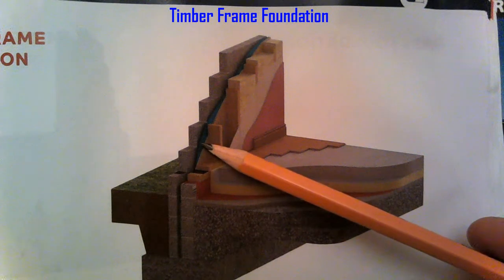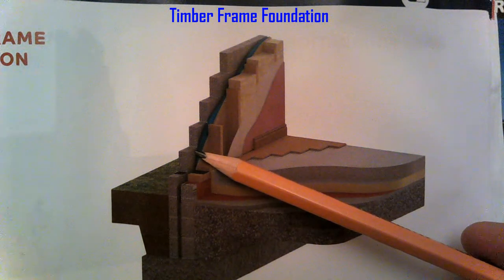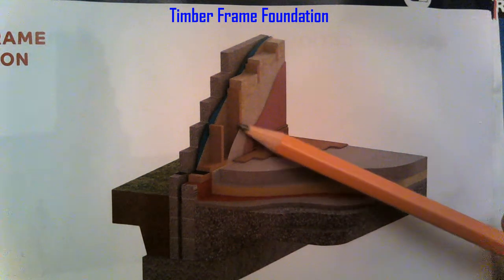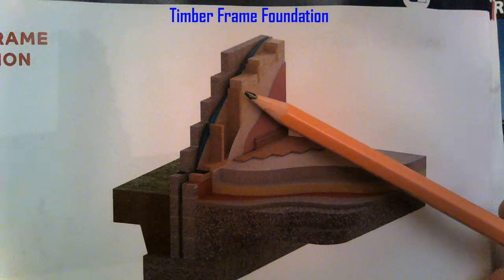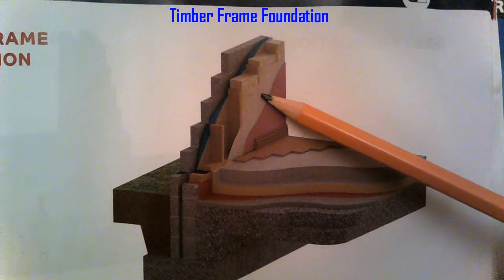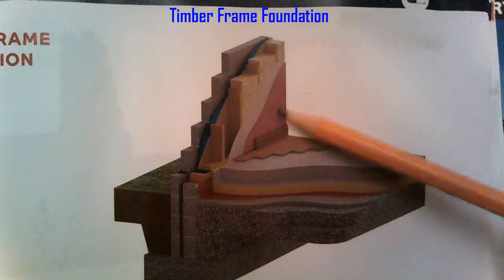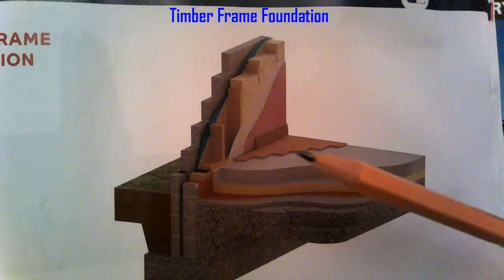The breathable membrane and 12mm plywood will bring our cavity down to 38mm. On our inside leaf we have insulation — usually rock wool insulation — shown with the figure-eight symbol. Then we have our plasterboard, with breathable membrane and a vapour check on the inside before the plasterboard goes on. Then we have our tongue and groove floor, and a render or skim goes on the plasterboard and tongue and groove floor.